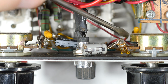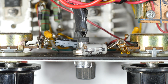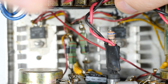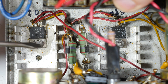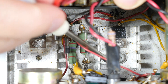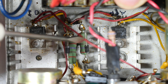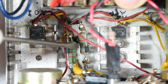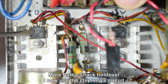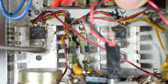Everything that's on one side is mirrored on the other side. There's just a single pilot lamp that tells me when there's power to the whole system. Pulling some wires out of the way, you can now see down into the bottom. We have the LM337T and its heat sink, which is also heat-sinked through the aluminum base I mentioned earlier. Then there's a resistor, a diode, and symmetrically on the other side, the LM317T. The circuitry is mirrored across the ground — negative here and positive here.